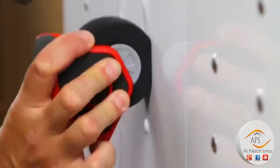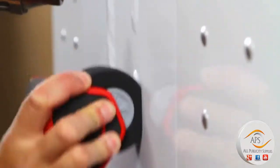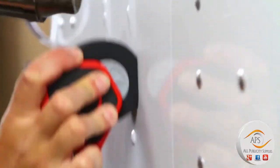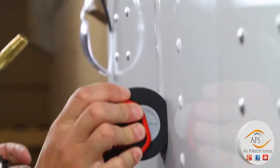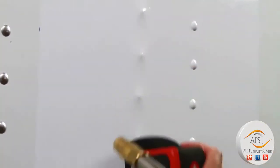If the application environment has a temperature outside the suggested range of 70 degrees to 80 degrees Fahrenheit, try a few runs of rivets using different amounts of heat and roller speeds to get the perfect combination. This can literally change from day to day in some climates. Whether you purchase a proper application wheel or just use foam paint rollers bought at a hardware store, be sure the roller is firm and undamaged throughout the entire application. For some rollers, this may mean that you will need to change it out several times during the application.